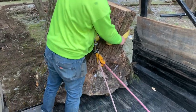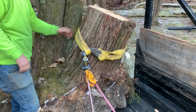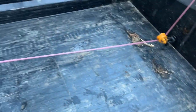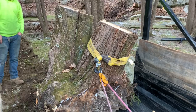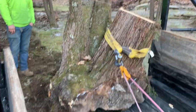Alright guys, so as you can see, we now got a small snatch block on the stump piece itself, and the winch is run down to another snatch block there, and then it's anchored off at this shackle over there. So anytime you add a pulley like this to the system, it essentially doubles your pulling power. So we should be able to slide the rest of the stump into the trailer